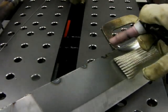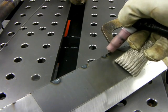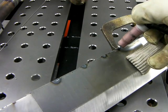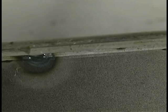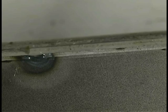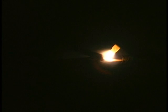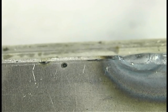If all I've got is a stick welder and I need to TIG weld a tank that needs to be watertight — a parts washer or something like that — I'd rather do this than stick weld it. If you've got a gap, you especially need some backing and it helps to light up on the backing, then add rod really quickly. You can see it's not way out of hand on the heat control. But you can also see a crater hole — that would be a problem. You've got to always light up and overlap and fill, remelt those craters if you're building something that needs to be watertight.